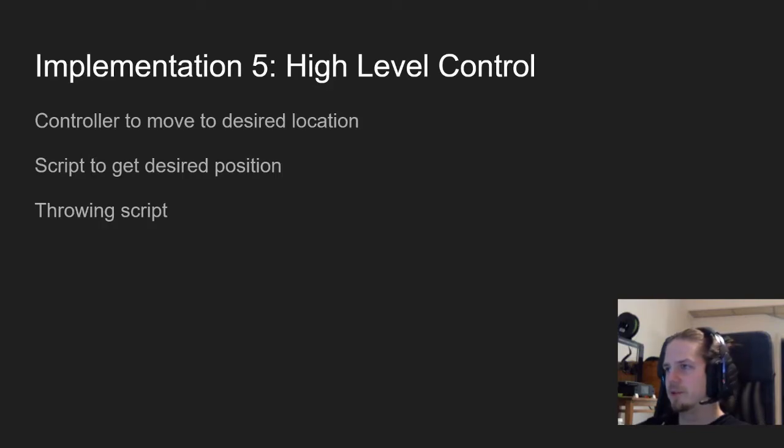With the robot being able to go to the desired position based on the angles we give it, you can think about the high level control. The purpose of the high level control is to figure out how to move. Now we can give individual angles to each motor, but we can't, as of currently, tell it to go to an x, y, and z coordinate. We can just say theta 1, 2, and 3 for the angle of each joint. The second part of the problem is to figure out what path to take to that point. Now there are many solutions to the inverse kinematics problem, and we want to find a specific one.